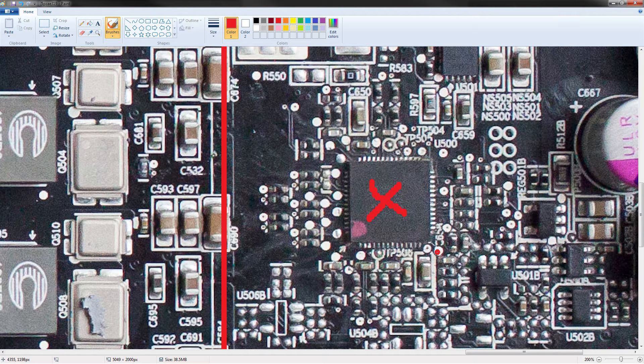However, memory voltage control — I don't think I've ever seen it done. If you have an Elpida chip-based card, more memory voltage is always good and you can occasionally get extra megahertz out of your memory. To do the memory voltage mod, you need to mod — counting the pins: 42, 41, 40, 39, 38 — this pin. Measure the resistance to ground. It's been ages since I last did this mod, but I think it needs a 200-ohm potentiometer to ground.